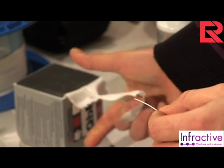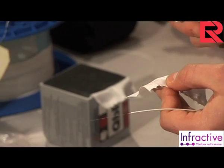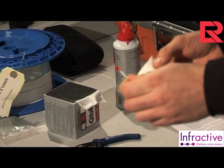This leaves us with the 125 micron inner fiber. We now need to clean the fiber to remove any dirt and grease residues that may be on the end of the fiber. Put some fluid onto the lint-free wipe, and pinching the fiber between our fingers, we clean until we hear a squeak.